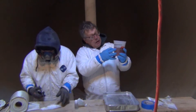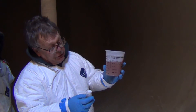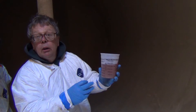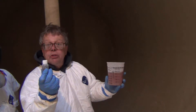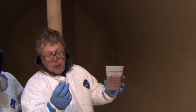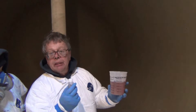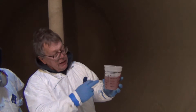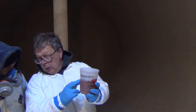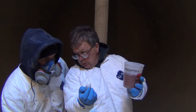For this batch, what I have in here is a half a liter. If you want this to take off quick, you would use one ounce of the hardener. So what I'm going to use is a little less — I'm going to use a half an ounce of the hardener to the half a liter. One half liter, one half ounce.